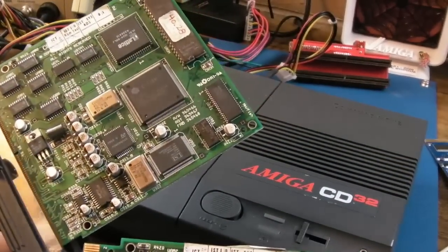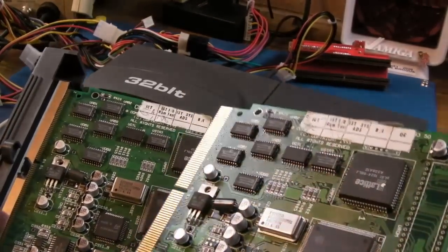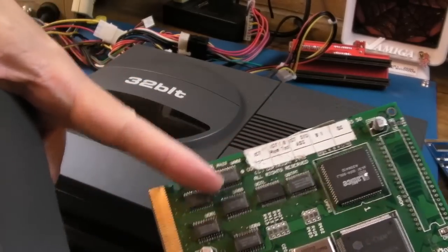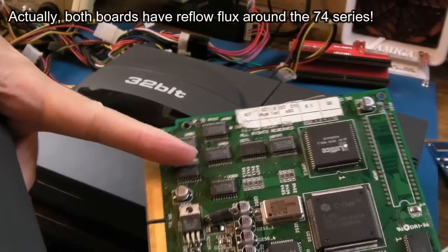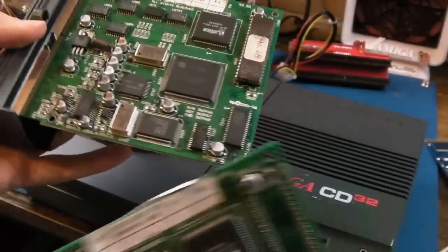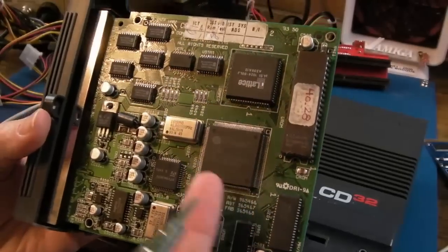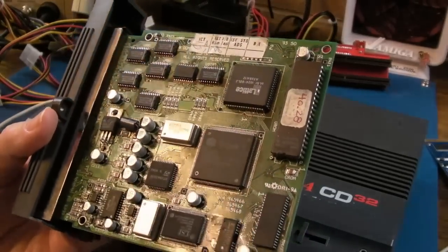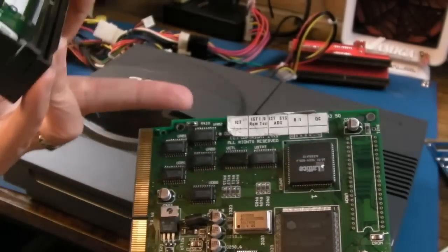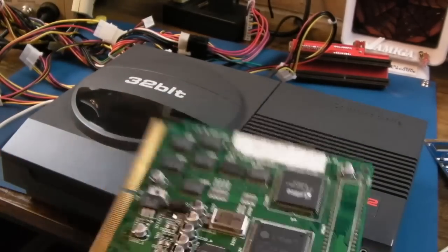This one's obviously missing the BIOS. On first inspection of these boards, one of them has had a lot of rework - all the chips up here look like they've been swapped or something. There's a crack on one of the caps here. The label was peeled up as if it'd been affected by hot air, and I can see some flux around them.